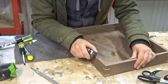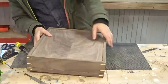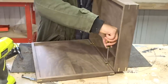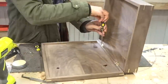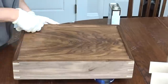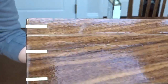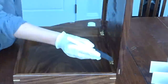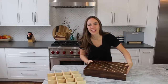I wasn't planning on putting a chamfer between the top and bottom of the box, but I realized I needed one to create a relief so the box would open freely. I used a block plane to make the chamfer. I then did the same Vix bit, steel screw, wax, brass screw process on the top. I decided to finish it with Danish oil because it's a super easy finish - just wipe it down, wait 15 minutes, and clean it up. I'm loving how the brass looks with the walnut. After the Danish oil cured I put on a layer of wax for extra protection.